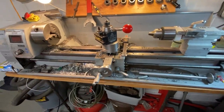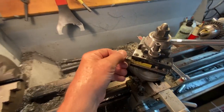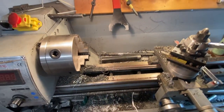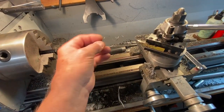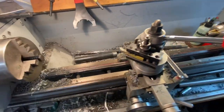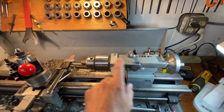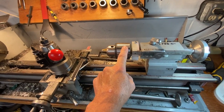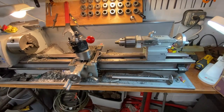It's a good little lathe for what I use it for. I have all carbide cutters except that shear cutter, and you just got to let it have it — don't be afraid of it. I used to take real light cuts and had issues, but now I take some pretty aggressive cuts and it's working pretty good. This thing does seem to go out of alignment, but you just got to reset it — it's got screws and all that stuff.